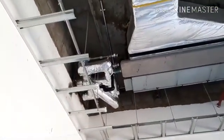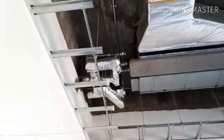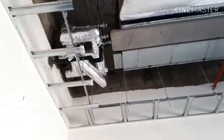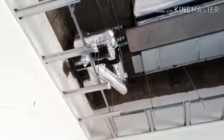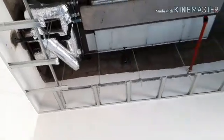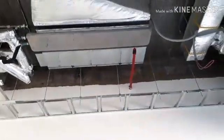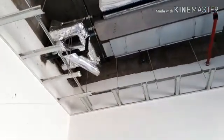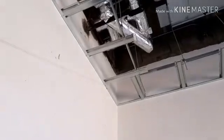As we can see here, on the left hand side we have one small pipe — that is for the condensate drain line. When the machine produces condensate, we have to drain the water, so we are connecting this condensate drain pipe to the machine with a one-inch pipe.